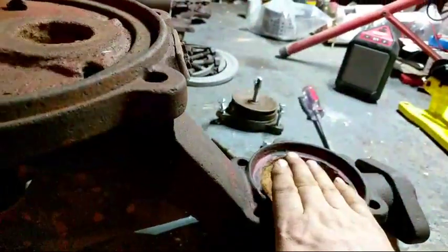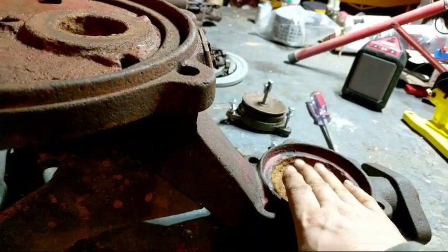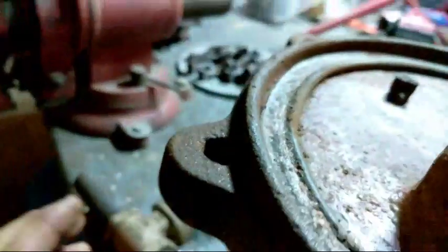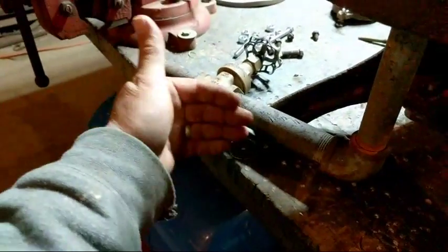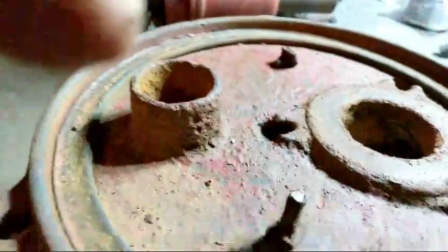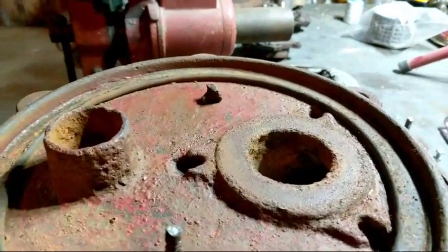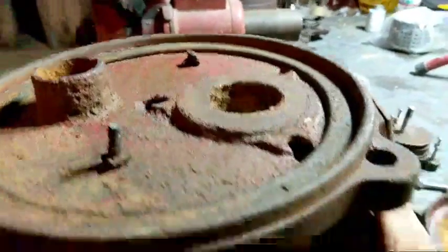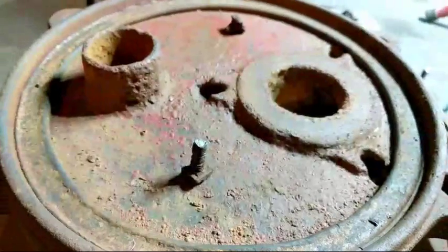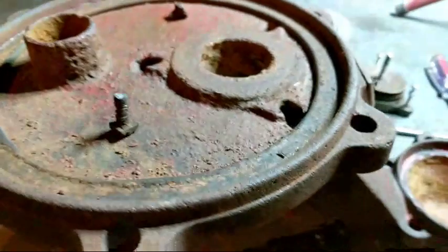This was used and designed and installed in places where you had dirty water, like groundwater from a river, a creek, a pond, a lake. And that water was the force to run the ram. And then you might have a potable spring or well or artesian well that could supply water to this port and flood this. And the cool thing is that the water would not mix. You'd set a standpipe up so that there'd be enough water to flood this area. So the dirty water would come out here, and this chamber, everything would be filled with the spring water that you would actually drink. Now that doesn't look very potable right there, but it was when it was new, and hopefully it will be again when I get done with it.